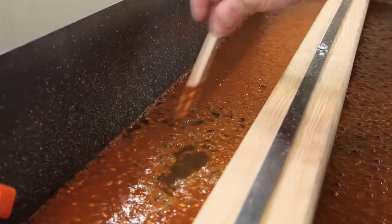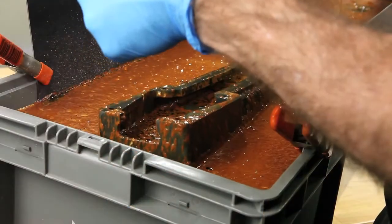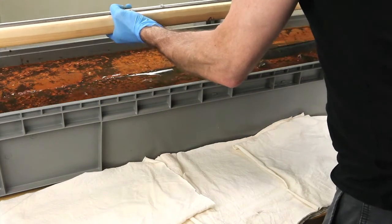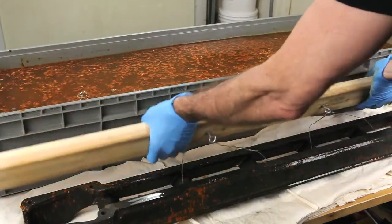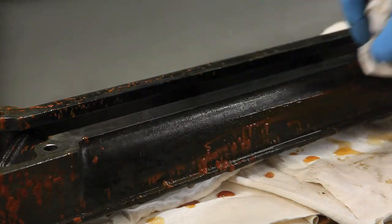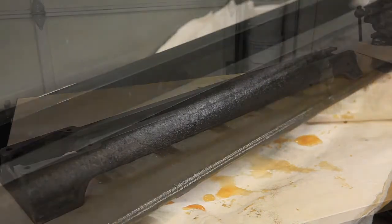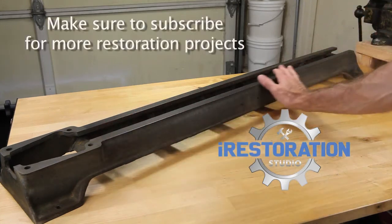I'm going to take it out after this eight hours. You can always unplug the battery charger, pull the piece out of the bath a little bit, and check the condition of the surface. Some pieces may require more time — I've had pieces going as long as 24 hours. Once you pull your piece from the tank, give it a wipe down, a little brush off, and you should be good to go. This can be a fun project to put together and it will give you fantastic results every time. Thank you for watching my video today. If you have any questions or comments, please make sure to share them.